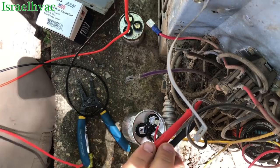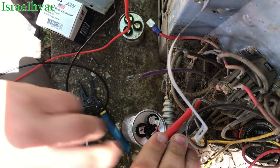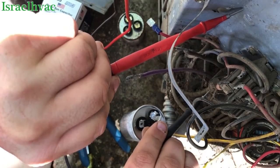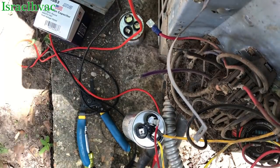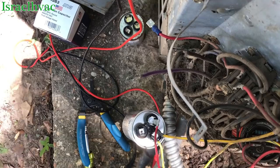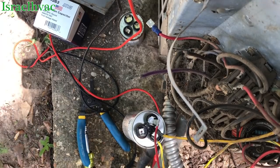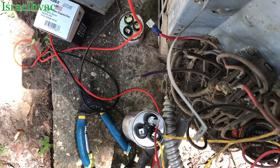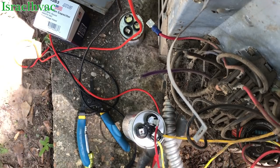You can see right now I'm checking power. I didn't have 240, but going from one leg to ground — right there I have 110, right there I have 110. I trusted the disconnect. I'm getting up to open the disconnect to see if one of the legs is wire-nutted and not being cut off, which it wasn't. But I still should have never trusted the disconnect. I should have checked power before I started this and I did not. I made a very huge mistake.